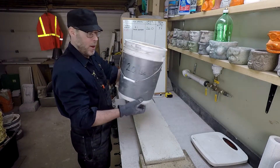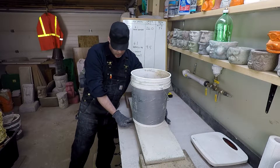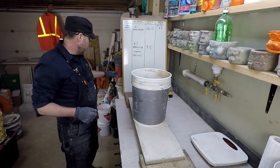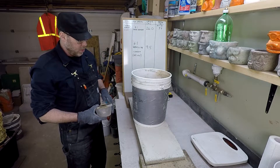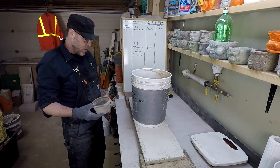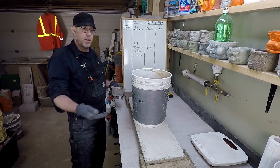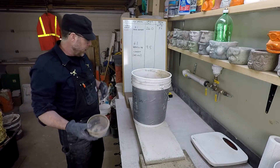Okay, step one — the bucket weighs two pounds. This is fully cured, over a month old, so it's at its full strength. I have a center mark so I'm trying to give it an even weight distribution. I need to scoop in sand carefully — not let it bang in there, since the force of impact is a different kind of load. I want to place it as carefully as I can. You would never span something like this with one-inch thick lightweight concrete and no reinforcement — it really is just a test made to be broken, but hopefully we can learn something about mix design.